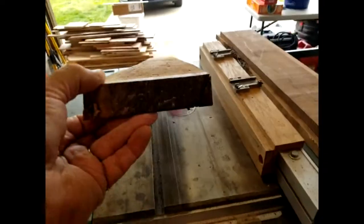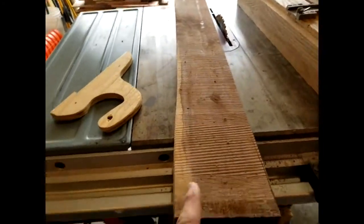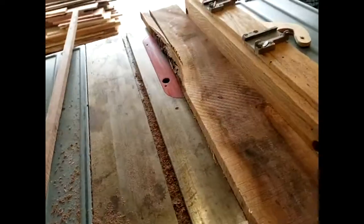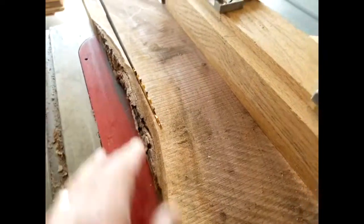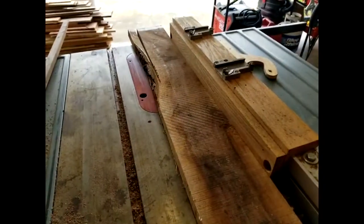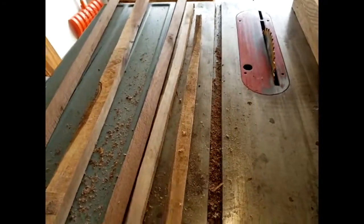This particular board — I've re-sawed this edge and it's got a little crack in it right here, about the thickness of a finger of waste. I'm going to use the straight edge to bring the rough-sawn edge to square, then come back and cut this off to get a good board out of the middle. I'm cutting right next to the bark to leave no bark on the board, just a little sapwood. At the price of walnut these days, I don't really waste too much.